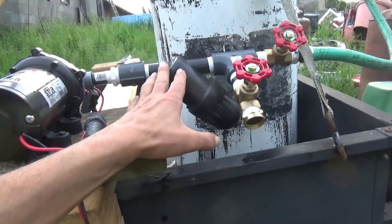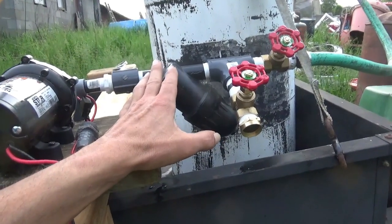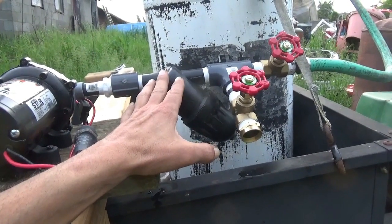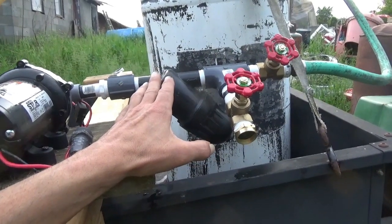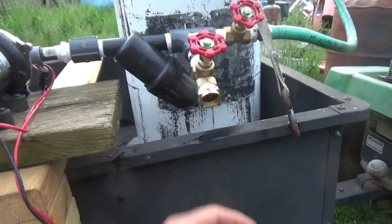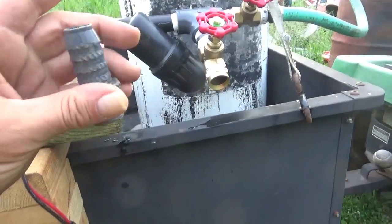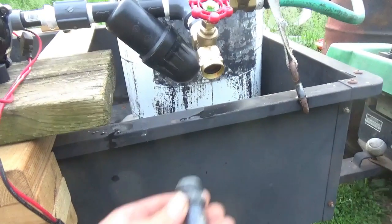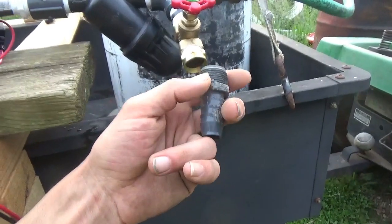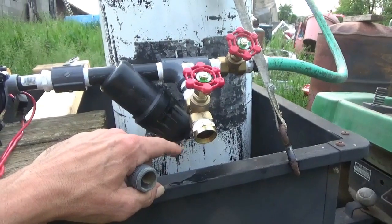And then in really dry season, if the ram pump shuts down, which it does sometimes, our water supply goes low, there's still enough to pump water from the spring or from the pond to bring water up. And so sometimes this substitutes in for when the ram pump won't run. And so I can do the same thing down there. Simply, this is set up to take a garden hose fitting. So with a little bit of gravity pressure coming into this, it gives us water right to the pump. And then in the event that I need to go down and use the ram pump, this threads in place of the garden hose adapter. And then I can plug that 3/4 inch poly line directly in and basically substitute this in place of the ram pump and pump water up top here.